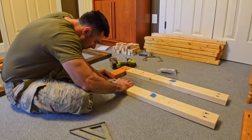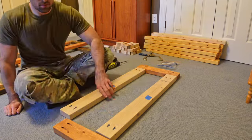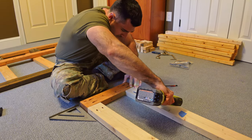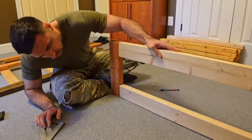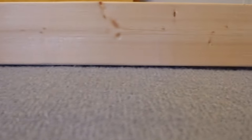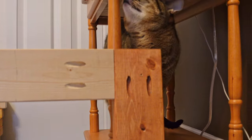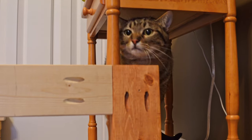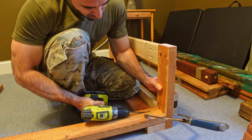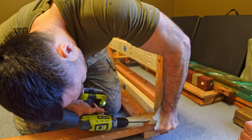With the rollout portion's face and bed frame support now assembled, I'm going to move on and assemble the end pieces for the base itself. The vertical portions for the end pieces of the base have pocket holes drilled into them. That's because I'm repurposing wood from previous projects and these happen to be the proper length, so I'm just going to make do with pocket holes that aren't going to be used. I only wanted the four vertical 2x4s that make up the end pieces of the base to touch the ground, so I raised the bottom horizontal 2x4 off the ground by a quarter inch. With the end pieces assembled, I now need to attach them. There will be a total of three 2x4s that connect them - two will go across the top, one at the front and one at the back, and one across the bottom.